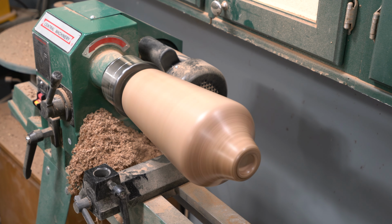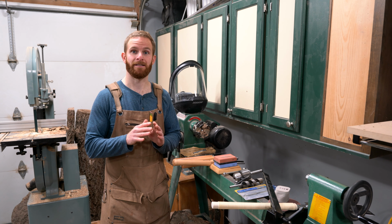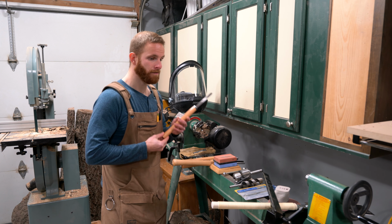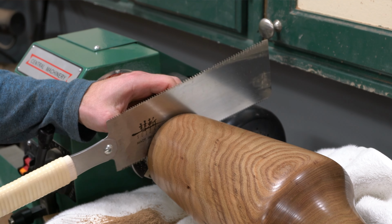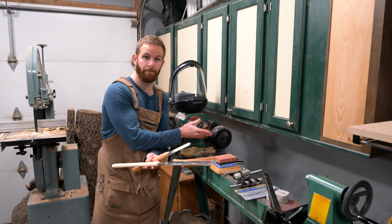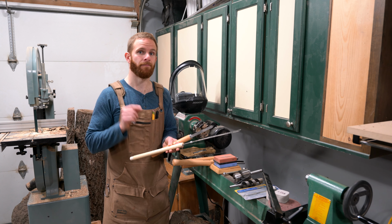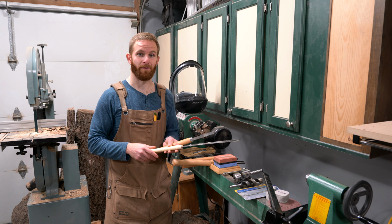After we've sanded the vase from a 40 grit all the way to 3,500 grit and we have a nice smooth surface and the vase is exactly how we want it and there's nothing else we want to do to it, then we can remove it from the lathe. And to do that, we're going to be using a parting tool and also this Japanese flush cut saw. And we're going to be cutting it off of the four jaw chuck nice and flat and flush so we get a nice flush bottom that sits flat. And so that's the last step you're going to be doing. And so that is a broad overview of everything we're going to be completing. And now we're going to be going into the practical application and all the steps that are required to complete this